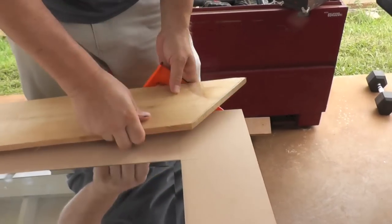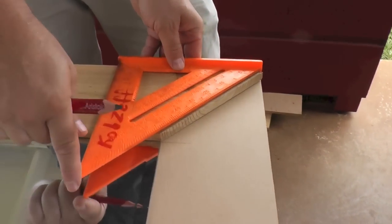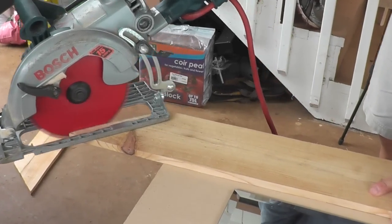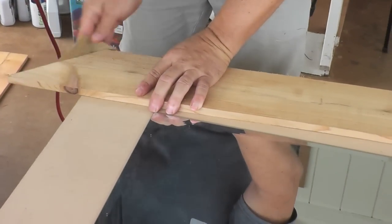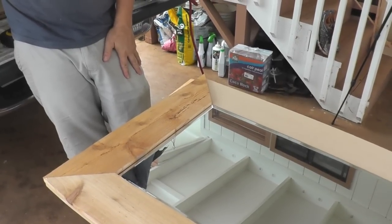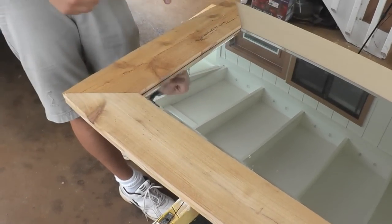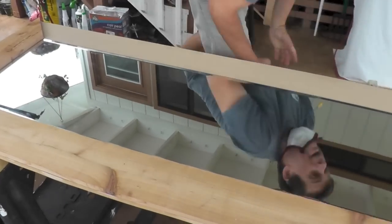You just go to the long point there and make a mark, then put your square on there — that's a 45-degree angle, which is called a miter. I'm going to miter the corners with the trim. I've already cut this down to 5 inches wide. A person could use a miter box if they don't have an actual miter saw — we don't have a miter saw either, just a circular saw. They make little hand saws where you put the material in and cut it. Or you can just go square and have the next one butt into it. Make that cut for all four corners.